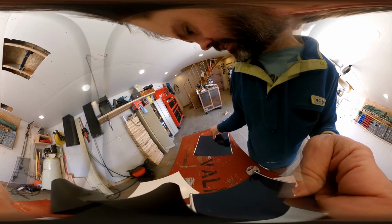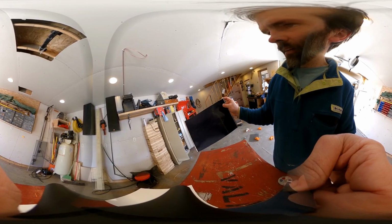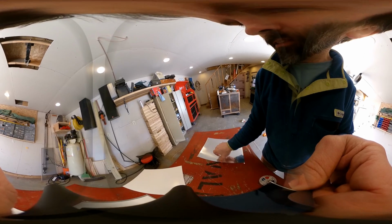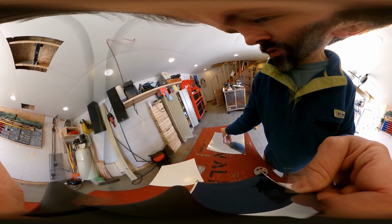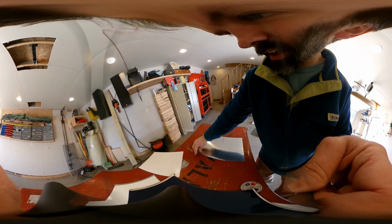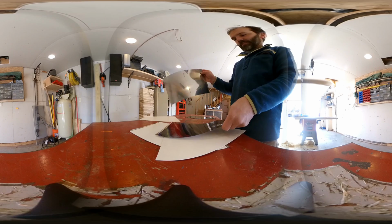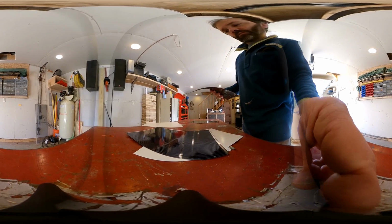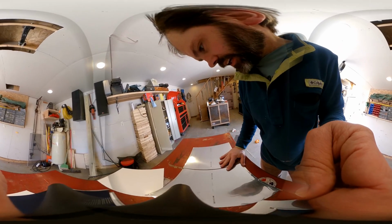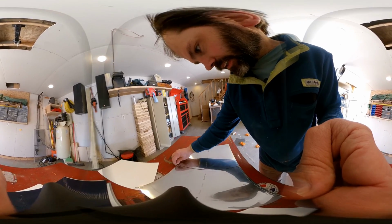All right, so here's the solar cells. These strips that you see on the left and right on the top side are basically positive, and then the back plane and the back strips are negative. When you assemble these together, you lay them on your sheet of glass, which protects them. I pull these tabs up, grab one, and slide these two together. The idea is to leave a little air gap between the two panels, like so.